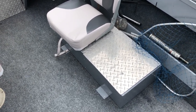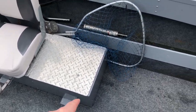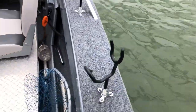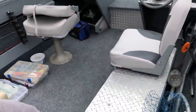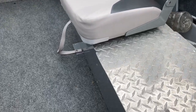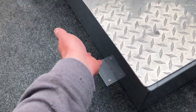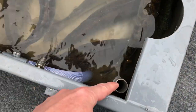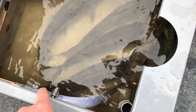This is a one-pump setup. The tank sits on top of the floor, and it's critical that the tank sit above the water level outside. I don't know if you can get a perspective of the water level outside, but depending on how heavy I've got the boat loaded up, it's critical that the water level outside never be higher than this standpipe. This standpipe is the outflow — there's no pump on it. There's a pump on the end.